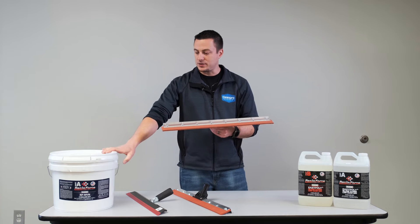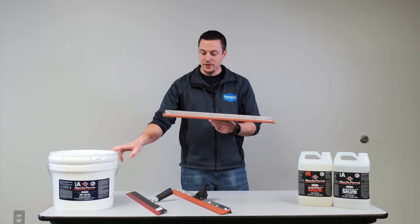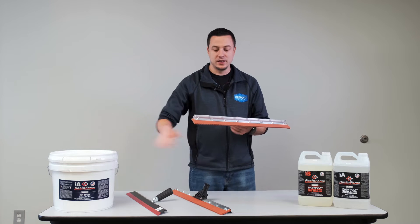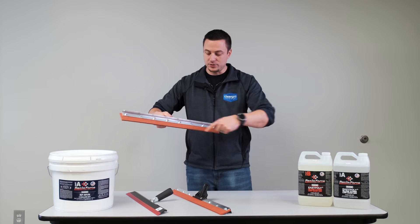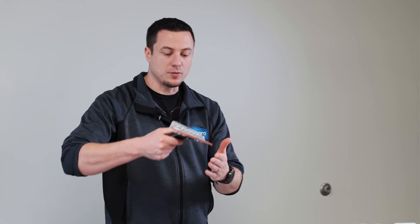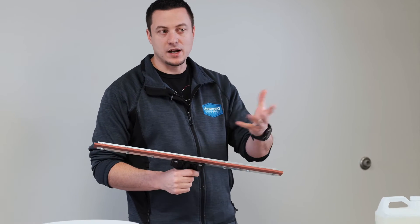If I'm going to put this moisture vapor barrier down directly to the concrete and I want to put it down at about 100 square feet per gallon, I'm going to choose this 1/8 inch notch squeegee. As I ribbon this out on the concrete and then pull it with a squeegee, it's leaving little trails or little beads in between every tooth of the squeegee. Then you go to back roll it to even it out, and that gives it about 100 square feet per gallon as a gauge. If you just lightly glide it across the surface, this 1/8 inch notch will give you around 16 mils, which is around 100 square feet per gallon.